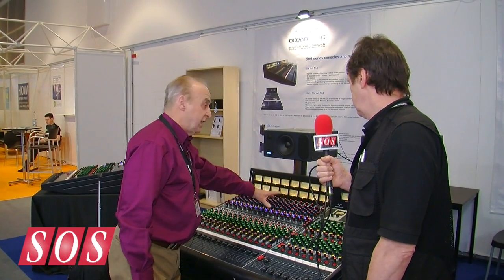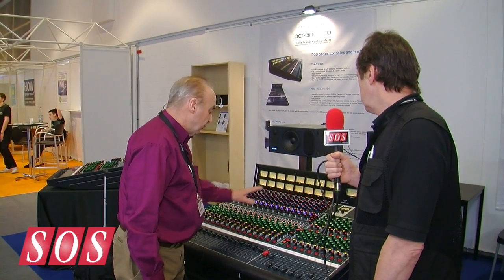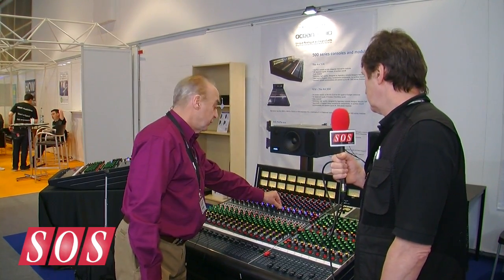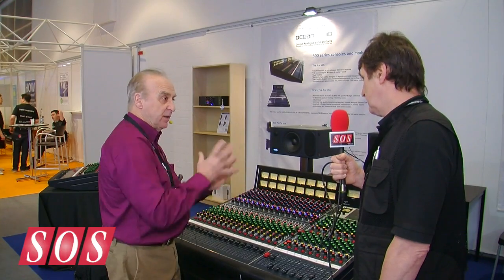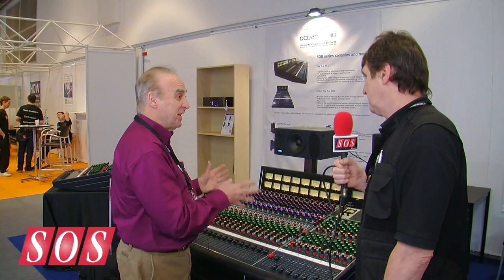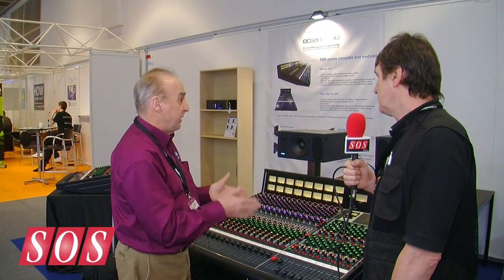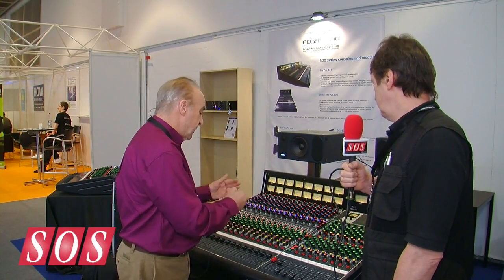So that's a pretty fully-featured four-band EQ on the channel. We've also added into this module a three-band EQ for the monitor section, so now we have high and low shelving and a swept mid-range for that. I've deliberately made the sweep on the mid-range slightly different to the other EQ, so it gives you a little bit of variance. We have bypass switches, and the 916, like the 516, will give you 48 inputs to the mix because it's a split and in-line console. You've got eight buses, six auxiliary sends, soloing, AFL, PFL — so it's a pretty full-featured console.